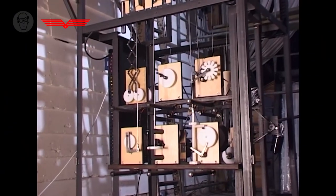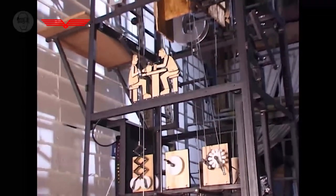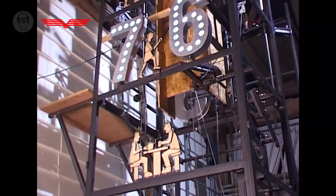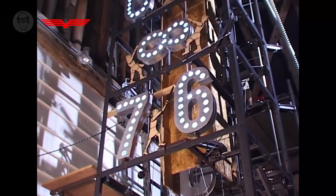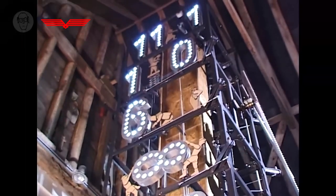So I often use torque limiters with chain drives for any mechanism that's exposed to the public so that they can't hurt their fingers if they do get them stuck in a mechanism. But also if the mechanism itself can get jammed. So this is part of a clock I made for the Exploratorium in San Francisco. There are 8 mechanisms on each side, and if any one of them gets jammed, the motor and everything else will still keep running because they've all got these torque limiters.